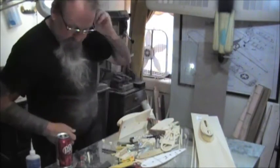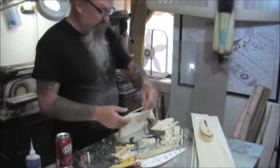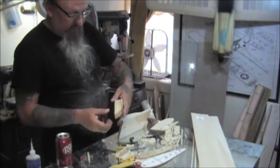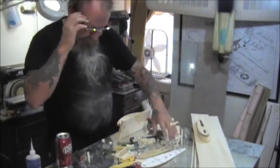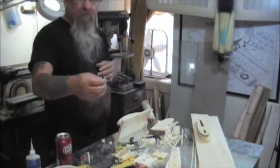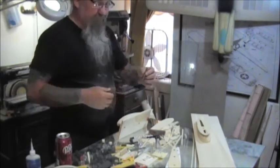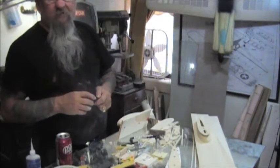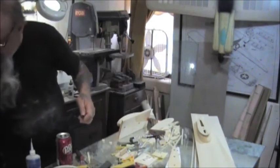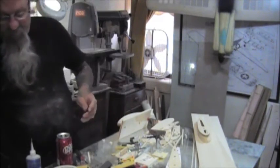So, how I'm drilling. If you drill with a normal drill bit, these holes become just ridiculously ate up. So I took a tube, an arrow shaft, like this. I skived the inside, and I put it in the drill press. Well, I figured it's not quite clearing, so I took a Dremel chop saw, like so, and I cut a slot across the top, and what that does is clear it.